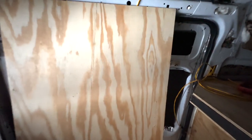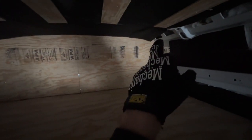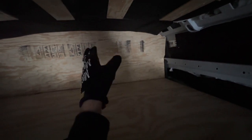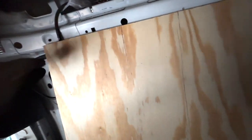I'm hoping that I get a good nice meet behind the plywood coming down and the sidewall coming up. And then I also decided, not like making all these changes, but I'm going to cut this just at a little bit of an angle, because over here it does pop out a little bit on the side. It's out a little bit more, so it hits in that corner before it's touching over here. It's not a big deal because the back wall would cover it, but just to be sure, and make my life easy, and that ends up just being a measurement up here, I will just cut it slightly at a slant so that it leans up against that back nice and soft, just a little something to make it good.